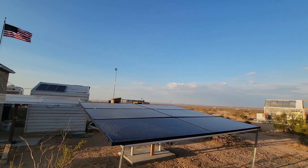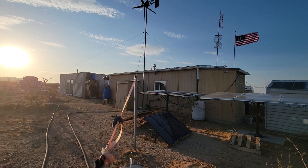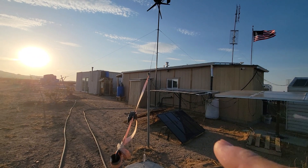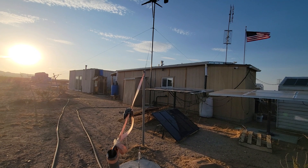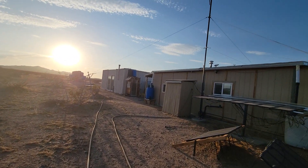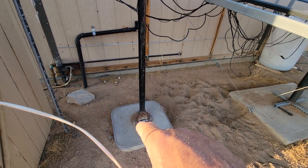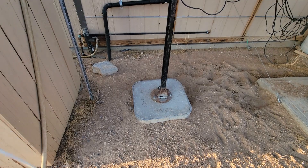What I did was drill a hole in the post about four feet up to bring the wires out. Before setting it up I dropped a string with a small weight down through the pipe, pulled the string out through the side hole with a wire hook, then tied my wires onto it and pulled them back through. Originally I had an electrical box at the bottom of the mast and was going to run conduit, but then I found I had originally set the concrete pole straight into the concrete — which isn't good, because sometimes you have to take these things down to work on them.